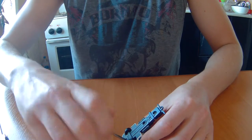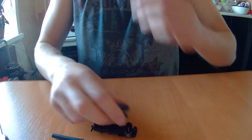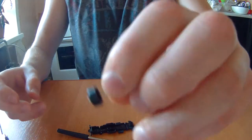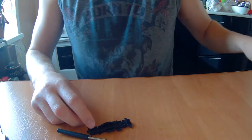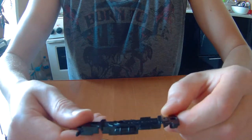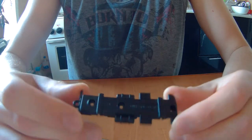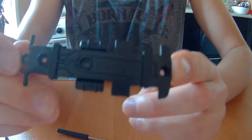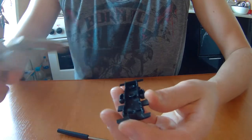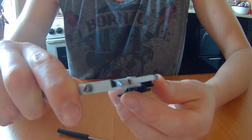There is only one screw here — and now it's disassembled. The wheels base is very simple, an open/close mold, not difficult for injection molding production. It does not have any details on the bottom, like in the previous video. Thickness is approximately 1.2 millimeters.